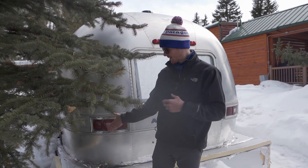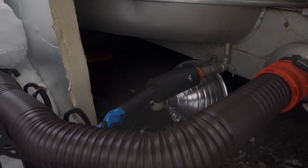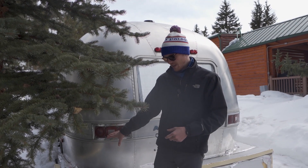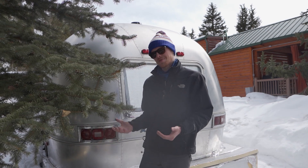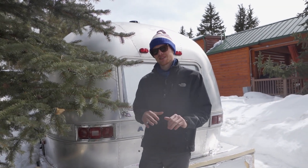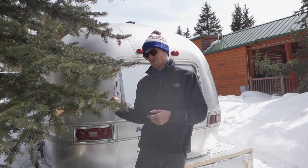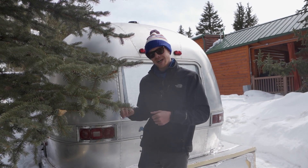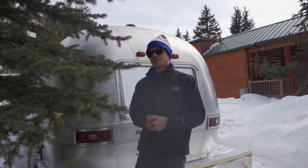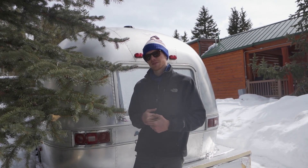That's the most important thing number two: the 250 watt heat lamp. It made a big help — it's pointed right on my tank, so it kept the tanks warm, it kept the area around the connections warm, and I believe it also kept the underneath of the camper warm. It kept the insulated area up a couple of degrees to where everything stayed liquid. And it probably gave us a couple of degrees underneath the camper warmer, allowing the floor and the inside of the camper to stay warm. So once we got set up and got the heat lamp going — negative 22, negative 17 — our water never froze, our tanks never froze. That heat lamp was a massive help.